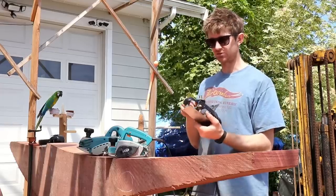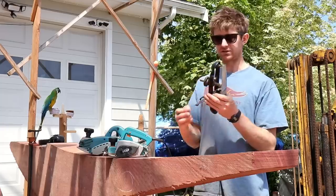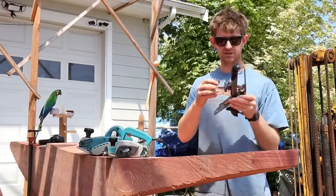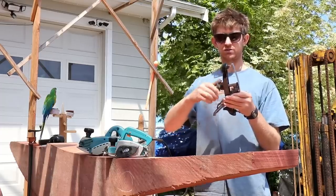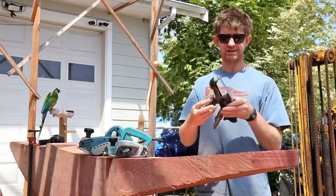This is a slightly more traditional style of compass plane. It's a Stanley number 20, and it's got a fairly standard plane blade arrangement in there, and you can adjust the curvature of the sole by using this big sort of set screw thing here, and that can go concave